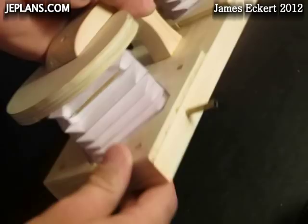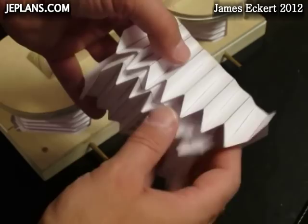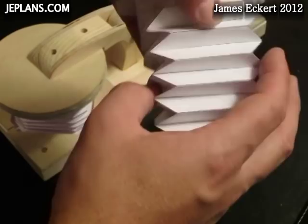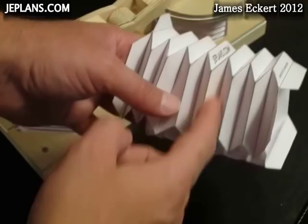Some of the flaws to the bellow: the paper in itself gets weak after use, and you end up putting little supports on. It's hard to get a good seal on a corner joint like this. In the future, I'm going to make a new bellow where the seam goes right down the middle instead of a corner — that way you'll be able to butt it together and seal it much more easily. Also, one of the plans is having a second piece of paper that glues on, which will basically double its strength so that it doesn't wear to a buckling state so quickly.